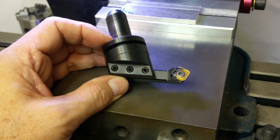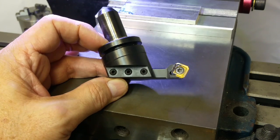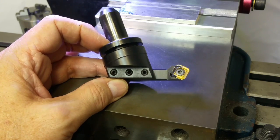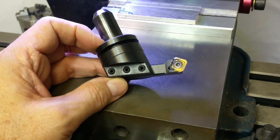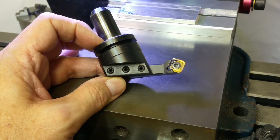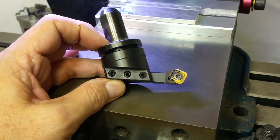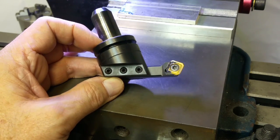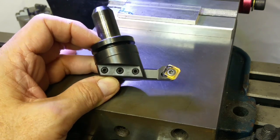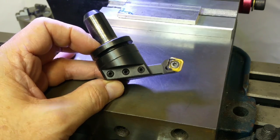If we pay attention, sometimes we can learn from serendipity. Suppose you're using your Superfly fly cutter and instead of setting the feed rate to 1 inch per minute, you accidentally set it to 100 inches per minute. And then suppose the depth of cut is shallow enough that it doesn't crash and the Superfly can actually keep up with that — you'll end up with a weird swirly pattern on the top where it's overstepping instead of just cutting a nice even level surface.